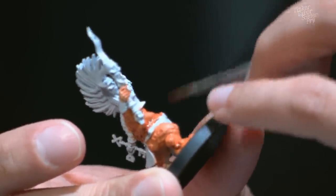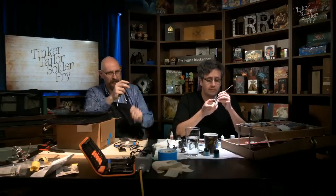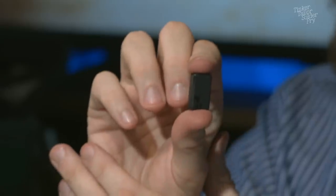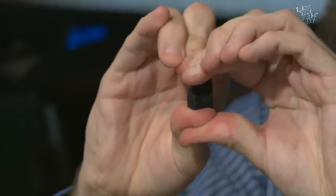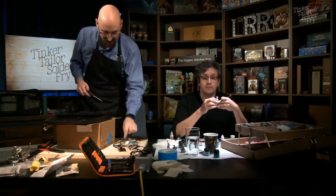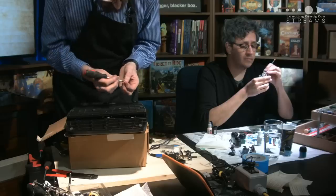Yeah. Oh, I should show off the little rubber boy here. He's tiny and squishy. Okay, and I'm going to pull that over to you then. If I can find your hand. Up. Thank you. Too far up. No, keep going. There we go. Look up. Look way up. This is what I've pulled out of my brake pedal. So you push the brake until you hit this guy, and then he goes... Okay. But now I get a proper linear response. Is it not going to bottom out, though? Oh, yeah, it'll bottom out. But you shouldn't be bottoming out anyway. You should have the ability to bottom out, but you shouldn't be doing that. Okay. Because you're braking. Let's get a big metal spring.